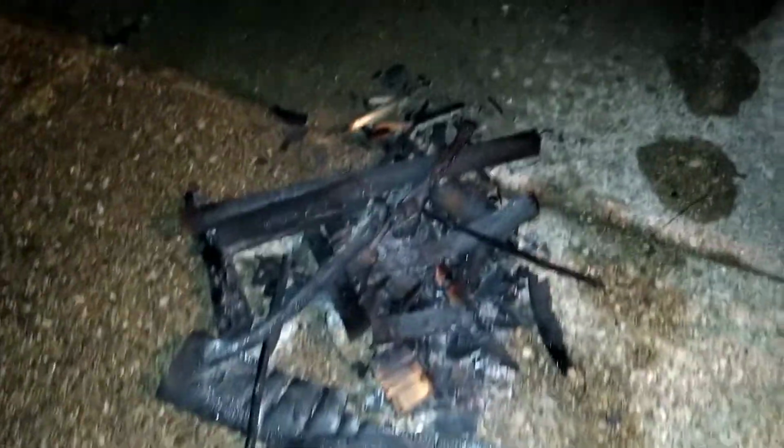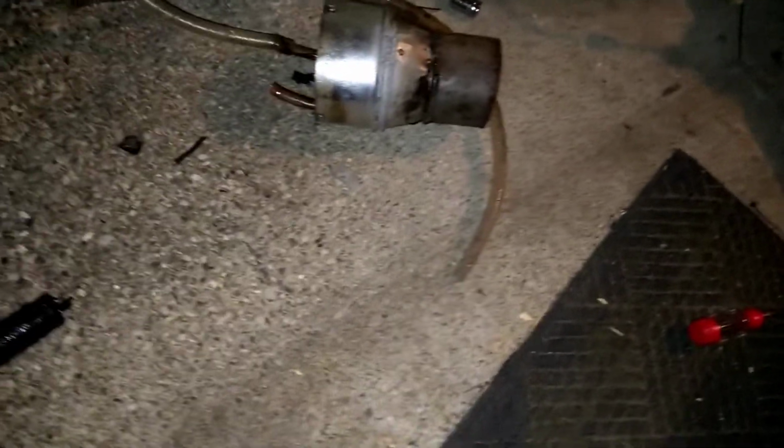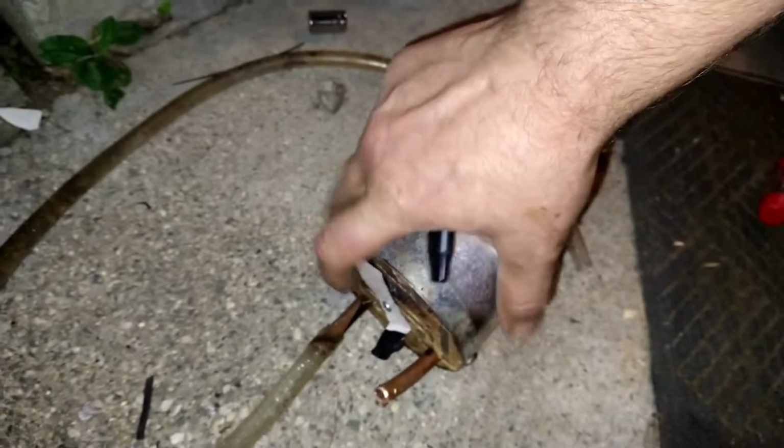Gonna run the old internal combustion wood gas generator slash lots of purposes and ideas and inventions device. It's a mouthful, but yeah. So tonight we ran it the other night. You may have saw the video. That's the wood. It actually continued to burn because this little device I created had not a good seal. I knew it wasn't going to be, but it wasn't at all. You could see smoke pouring out the bottom. And it was running for a good couple hours just off of the tiny little air vent that I created right there. A little slide air vent. It was closed, but the air leakage going by was enough to create a flow.